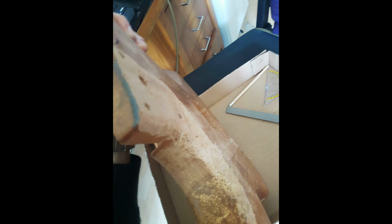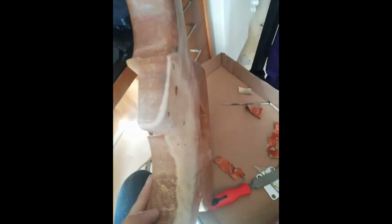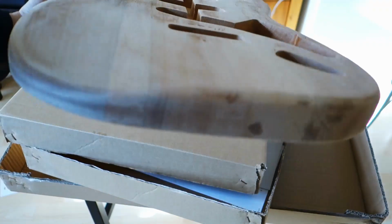So basically what I did to achieve this effect is I carefully penciled out where I need to go and just took a rasp to it and rasped away until I felt that enough material was gone. And then I just took another file and made it straight, and got my Dremel tool and a bit of sandpaper and sanded it all kind of smooth, and smoothed it out with even more sandpaper, and there it is at the stage it is right now.